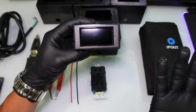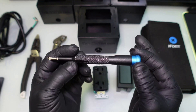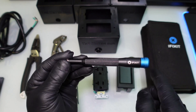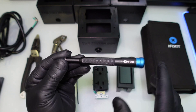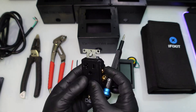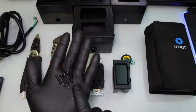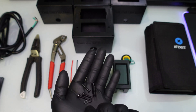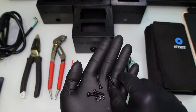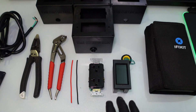You could even do this at your house to write off your electric bill. I just removed the Phillips head screwdriver from the iFixit kit — what I love about it is the swivel that it has, like a stationary bit you can palm and twist. I'll leave a link to the Amazon store in the description below with a tool section. Now we're going to remove the screws on the outlet and discard them, because the meter box actually sends you screws to use — two with nuts for each side of the outlet, and four coarse thread screws for all four corners of the meter box.